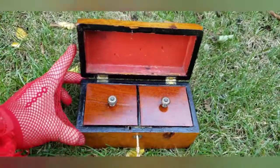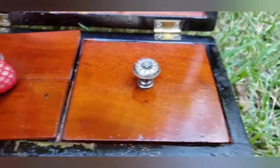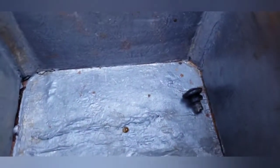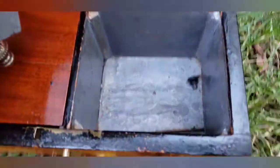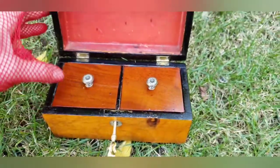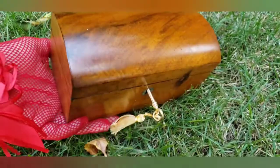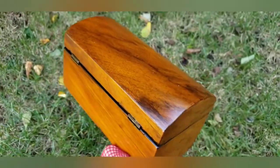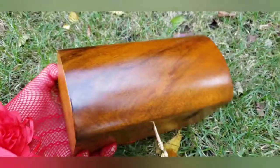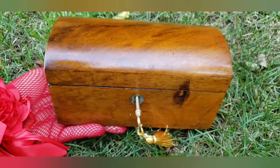This has very very old paint in there — they painted it a reddish color. They once kept tea in here, and tea was a very very expensive commodity way back in the day. Sometimes they would line it with tin — here's the old knob that's the original, and you can see this very old tin that would keep the tea from molding and keep it fresh. Howard's Restore Finish is not a cure-all — it doesn't make everything look perfect, but it makes things look a heck of a lot better, especially very very old things. The polish really did a good job and the pigment from the restore finish actually evened out the whole tone of the piece. Thank you so much for watching and have a great day wherever you are in the world — see you all soon with another antique restoration!